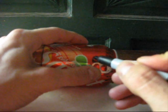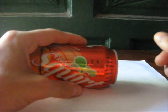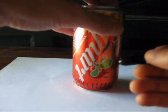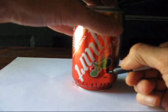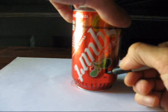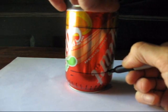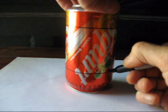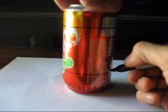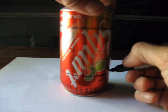This dimension should now be approximately one and one quarter inches. Now we'll flip the can back onto its top and hold our sharpie as secure as we can at that second marking — one and one quarter inches up from a flat surface — and spin the pop can 360 degrees, trying to maintain steadiness with the hand that's holding the marker, just like so.